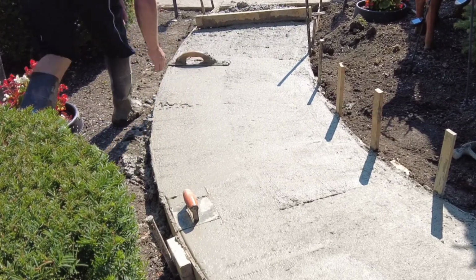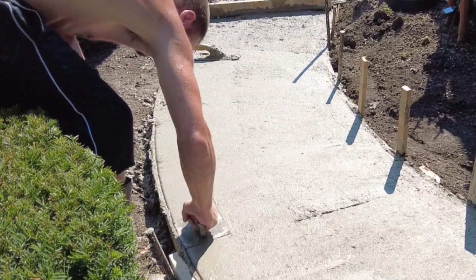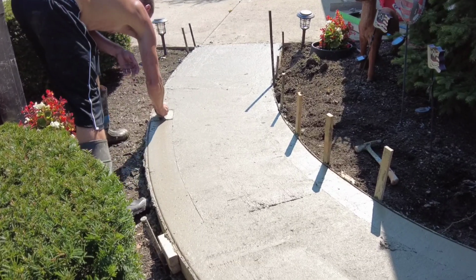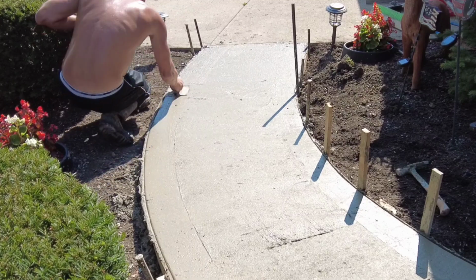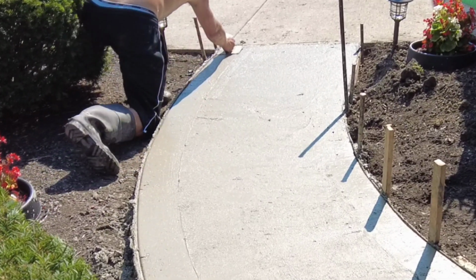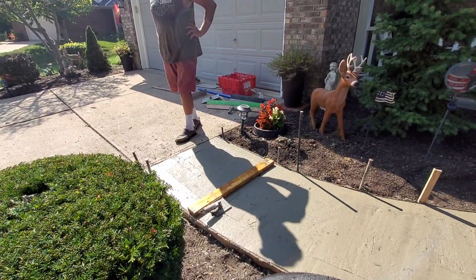So if I want a saw cut, I'm going to try to get it as narrow as possible. I don't know, that's just how I like concrete. If it's at my house, I'm going to saw cut it. If it's a sidewalk, I'll probably hand tool it unless everything else is saw cut. That's the only time I would use my demo saws, to saw cut a sidewalk.